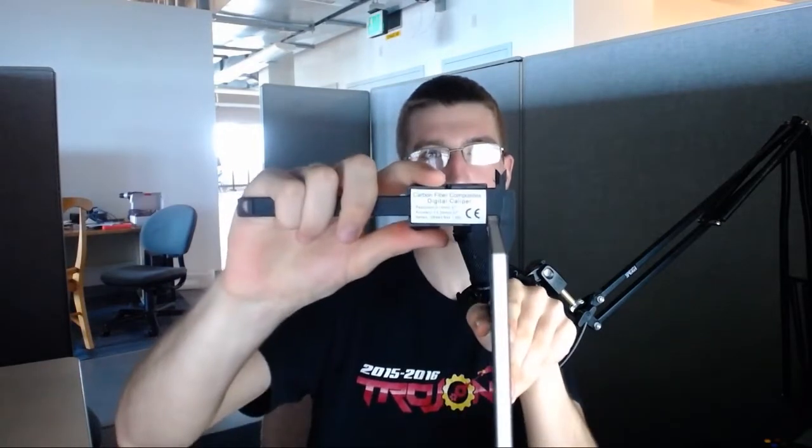You want to grab your material. This is the two colors, engraving plastic. Get your calipers that came with your Carvey, switch them to inches. You're going to want to go ahead and measure the thickness of your material, and that's going to be the base for your design.